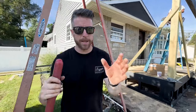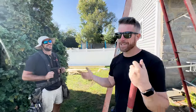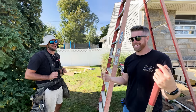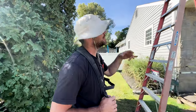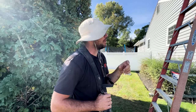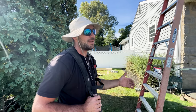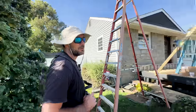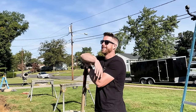We're making a mess out here, which means we're making good progress. We've got a standard pergola going up — a 2x8 ledger lagged to the house, and a triple 2x12 beam on the six-by-sixes. Jose is throwing in some structural lags to tighten up that beam. Once that's done, we'll put the concealed hangers on and run some rafters — two foot on center — to prep for a nice polycarbonate corrugated standing seam-style roof cover. Nice little modern design.